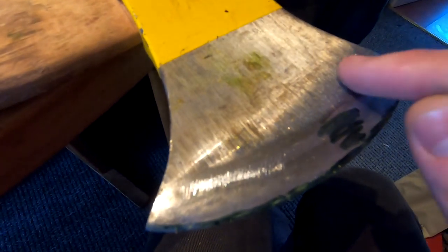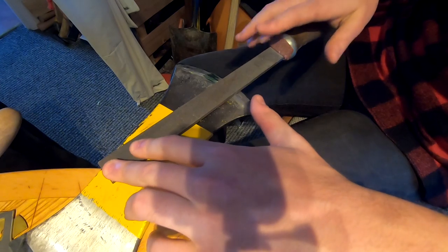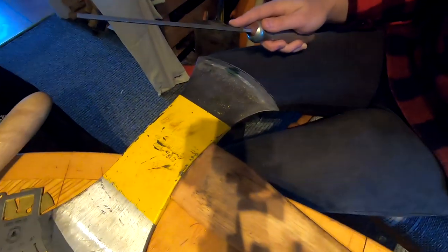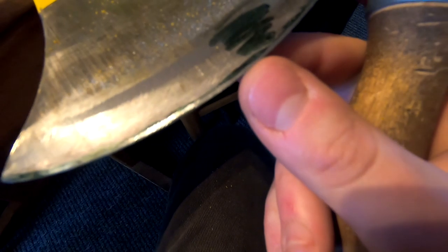This edge has a lot of work to do on it. Assuming I've finished that — so I've got shiny metal all the way down to my first Sharpie mark — I would then lightly cut the bevel with the smooth cut file. I put the file down flat with the eye, bring it up to about double the angle, look very carefully, and you can see I'm removing the Sharpie mark. That's my micro bevel. Normally I'd only do about three passes of the file each side, depending.